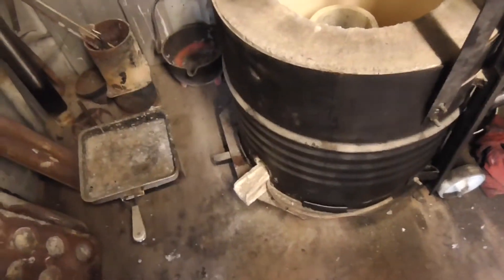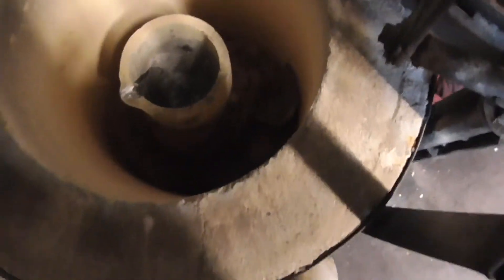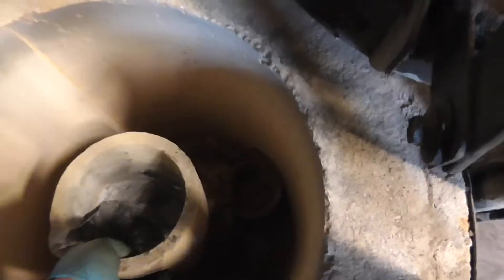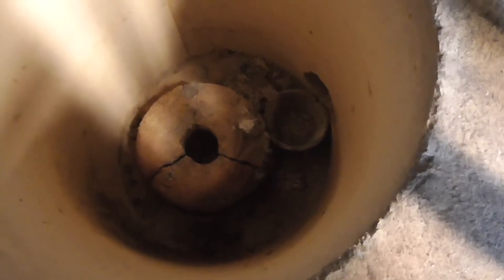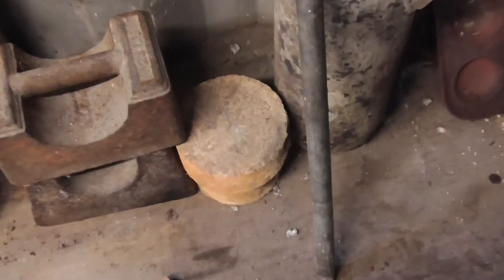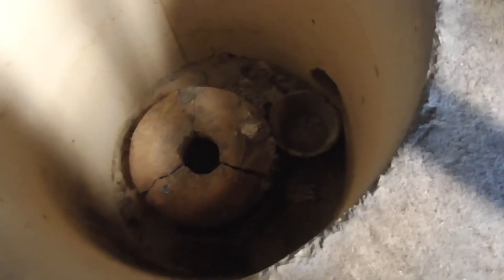The furnace is designed to direct melt. There's a sprue - we call it a sprue - there's a pouring point there, and it's just bunged off on the inside. So it's a bit grotty in there. That's my smallest crucible, and the plinth which broke up a long time ago. That's the Mark II plinth actually - and there's the Mark I, which is just a solid block, and that's reinforced with stainless steel. The reason this one broke up is because I forgot to put the stainless steel in it when I cast it. You can see that it's not entirely solid underneath - it's hollow - and it's just to let heat get in underneath. But I've never had a problem with stability with them, so I've just left it in there and it works fine.